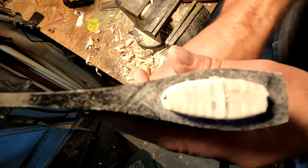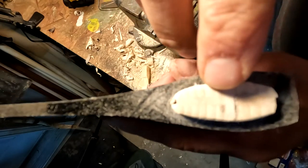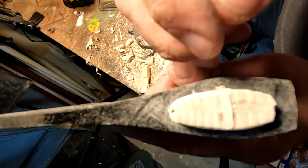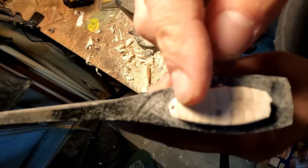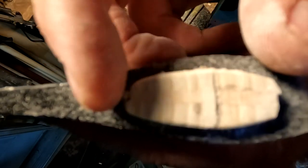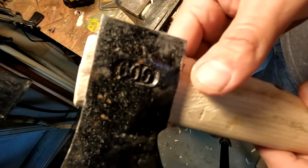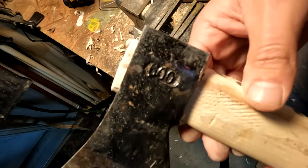There we go — the one-two-three wedge technique. With a bigger axe you'd actually use more wedges: two going this way and three going that way, five wedges total, if you're doing the wooden wedge technique. But see how neatly those all fit in there. The top of the axe is wider than the bottom, so there shouldn't be any slippage — this should hold really well.